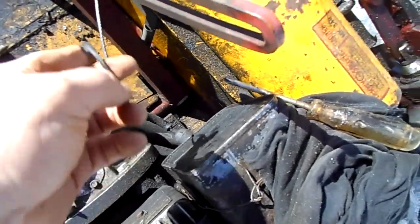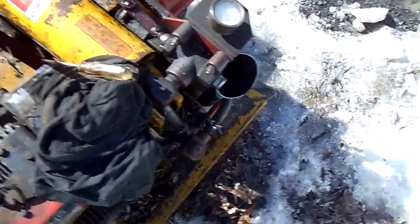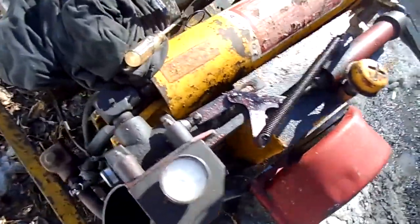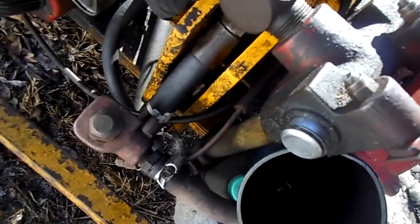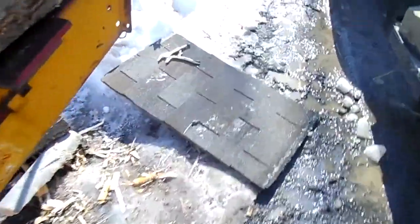So I told you, a cable runs around over a pulley up the other way. So you don't get access through this side. You get all the hydraulic hoses in the way. Right? You don't want to take all of that stuff off. You access from the other side.